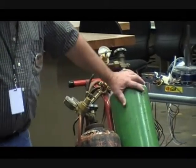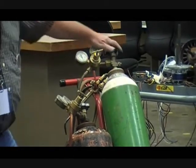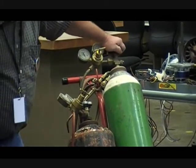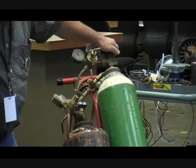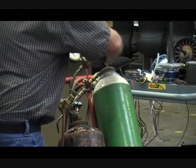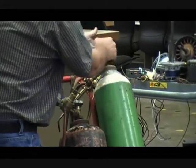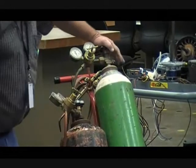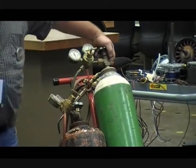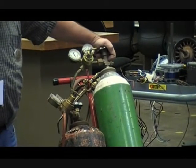A little different precautions we have to take with the oxygen tanks. They're under very, very high pressure. I stand to the side when opening — once again, head to the side. I have on this tank about 2,200 pounds of pressure and it's not completely full. 2,200 pounds.